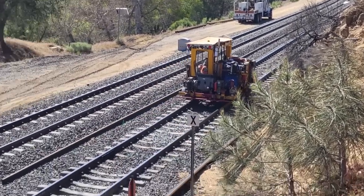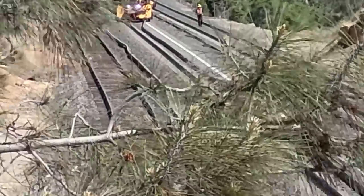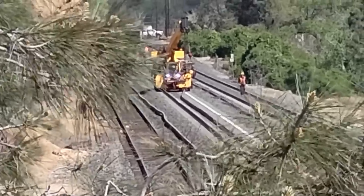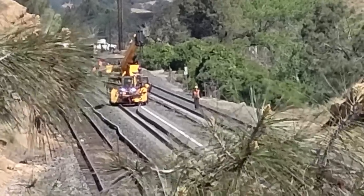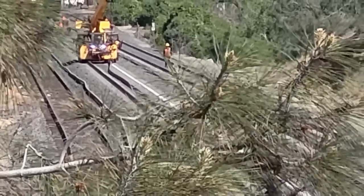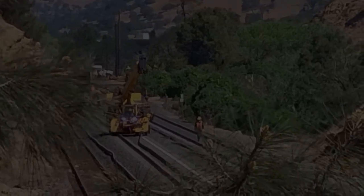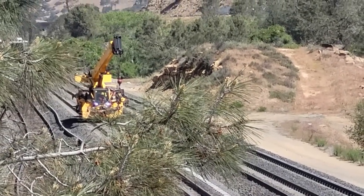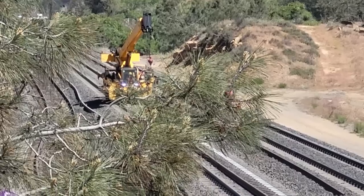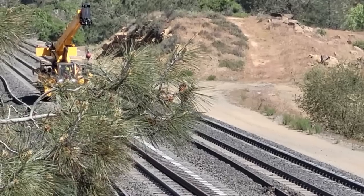The rest of them are all on-track vehicles, other than the speed swings themselves, and as they complete their tasks, they will move these out of the way, as those machines up there are. They'll go up there and park behind them, set their cones out, and wait for everyone to catch up. And here they come, laying the rail in place — it doesn't take them very long to do that. Especially on a tangent track like this — straight track — they can move right along. Again, these guys are very experienced, very good at what they do.